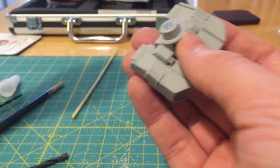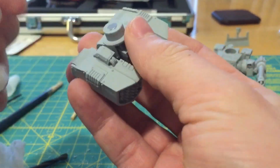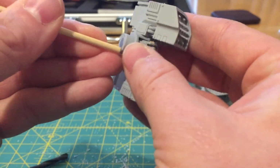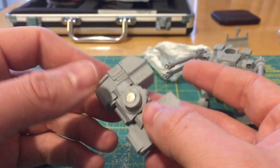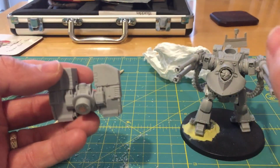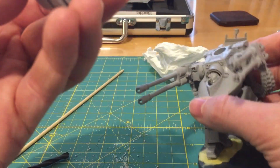in a situation like this, because whenever you're working with super glue, the adhesive can set very quickly, and because it's going into a tight constricted area, you can very quickly run out of time on manipulating it. That's one advantage with epoxy: you have more time to manipulate your part. Even a quick set epoxy, you've probably got 5 minutes working time.